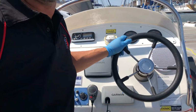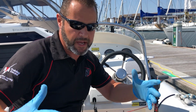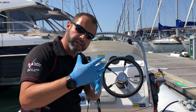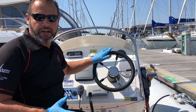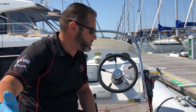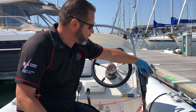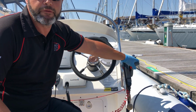The other thing we just need to check for is to make sure there's no ropes in the water, there's no debris, there's no big patches of weed. So we want to make sure that we have a look down and look where the propeller is, that's all clear through there. And then we've checked the steering, we've checked there's nothing down there, we've checked the telltales coming out of the engine. And then with the throttle control, we're just going to lift the red handle, which is where it's locked into its neutral position, it can't move from there.